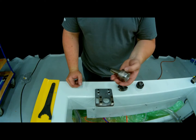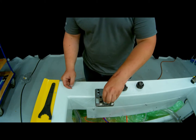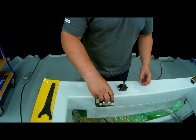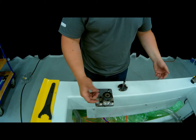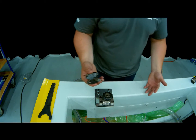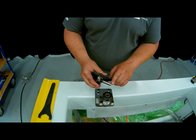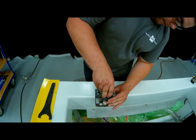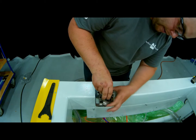We're going to throw the tool holder into the vise. There are these flat pieces right here that'll line up perfectly onto the vise. Then we can start threading on our collet nut. Once you start feeling some resistance from the collet nut, that means it's time to put our cutter in. The good rule of thumb is to throw in the cutter about three quarters of the length of the shank, so about three quarters of an inch in, and tighten it down by hand first.